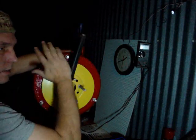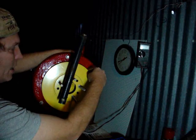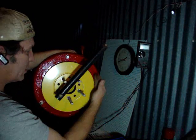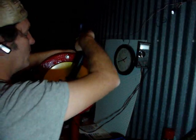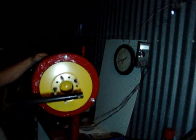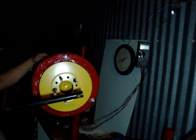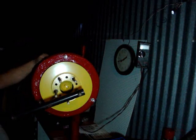This is a very efficient alternator. It's going to spin freely until the RPMs reach the battery voltage. At that RPM, any more RPMs try to make the voltage go higher, but the battery ties it down — that's when amps are drawn in. The extra pressure: if I spin this like this I can't put much pressure on it because there are no amps being drawn. As soon as I put amps to it and spin it around, touch it — it stops. And that's only one of the coils.